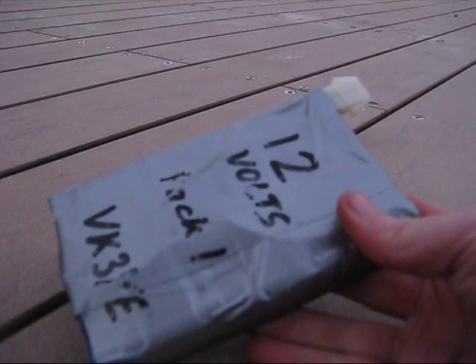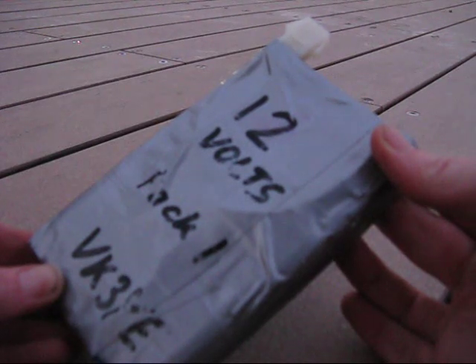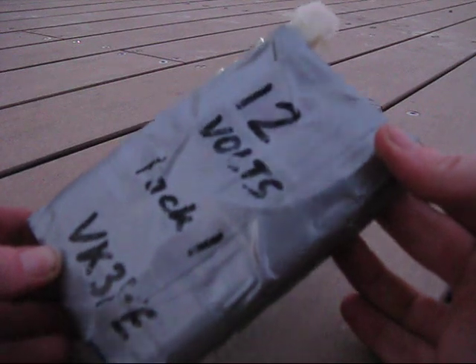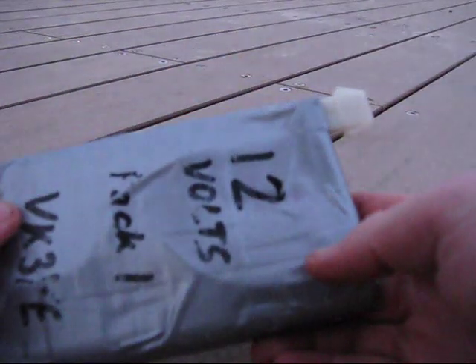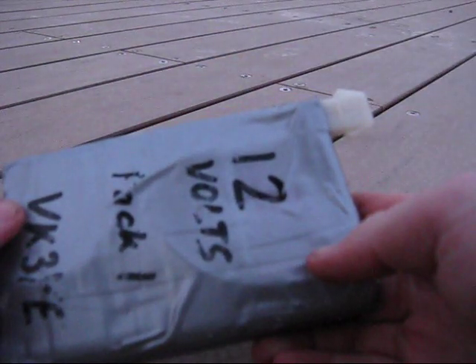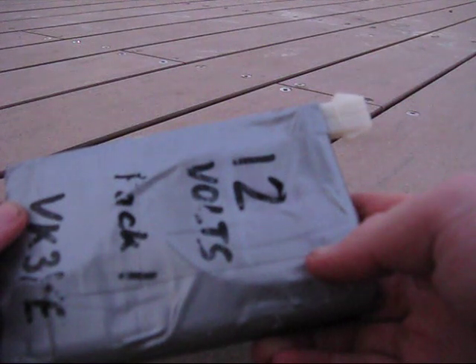You're going to ask what I used as a battery. The packs cost about two dollars from a hamfest and were originally from medical equipment. They were 24 volts, so I split them into two 12-volt packs, wrapped with gaffer tape, and put a socket on so I can plug in leads to various QRP transceivers. I think it's around 4 amp-hours, but whatever it is, I get hours and hours of use — particularly with something like the TenTec that draws very little on receive.